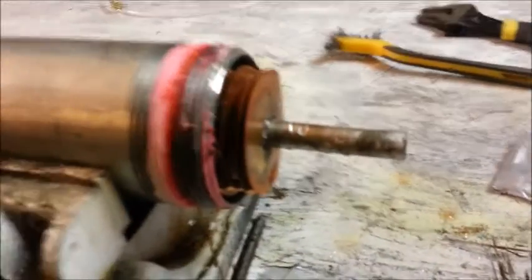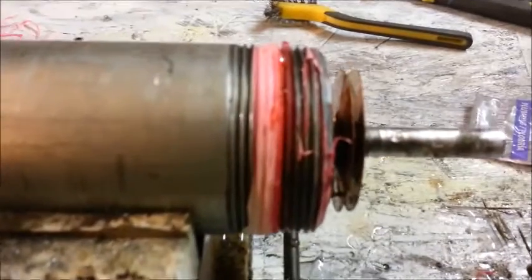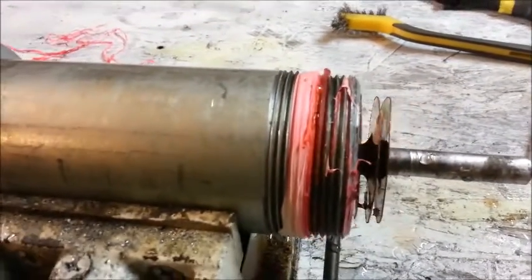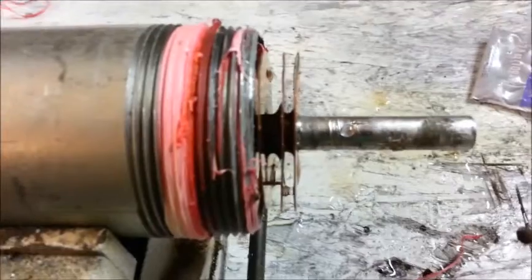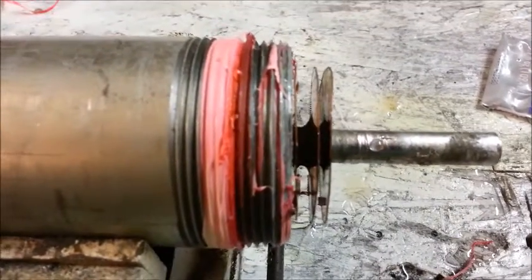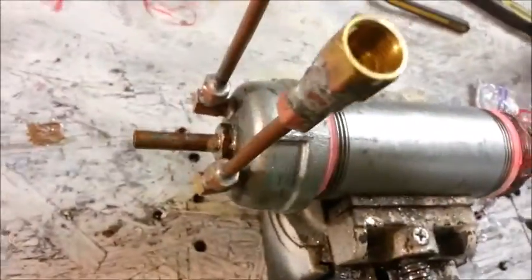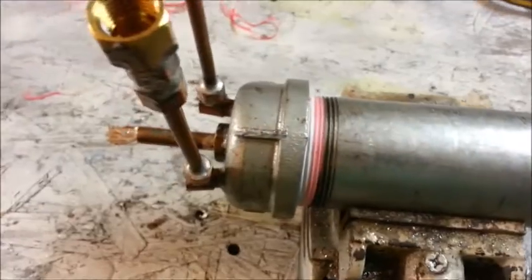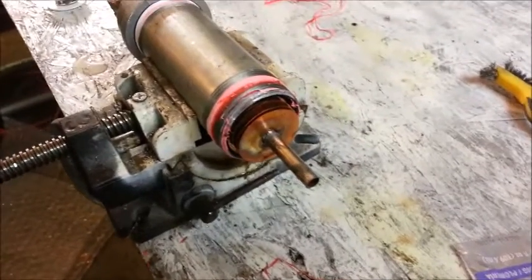I did an air pressure leak inspection and it turns out that I forgot to put pipe dope on this, and Teflon tape alone just isn't enough. So huge error on my part. But in that process I noticed I think I may have one too many fins on here possibly. So I've got to take this other side off too and get some pipe dope on here. Huge failure on my part.